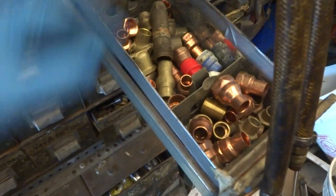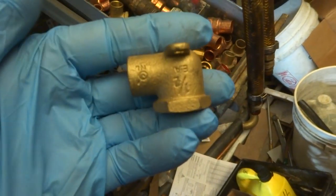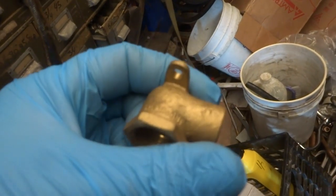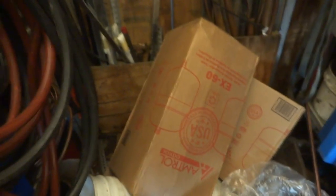Alright guys, what we'll do is put a drop ear female in there, put a hanger on, and hang the tank right off the pipe. We'll disconnect that other tank right out of there — I got another tank right there, a number 30 we could use. I just have to put a hanger on it. I'm gonna hang it right here, clip it through the beam to take the weight of that tank.